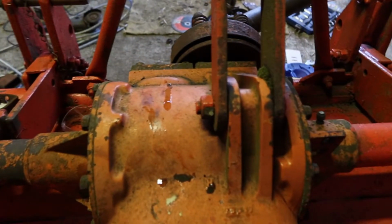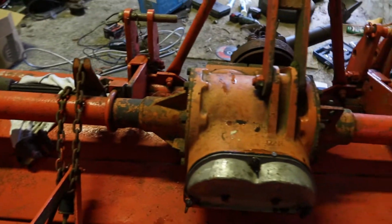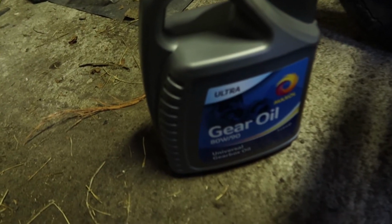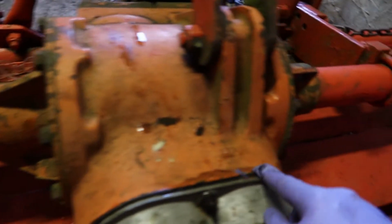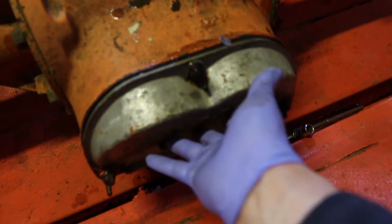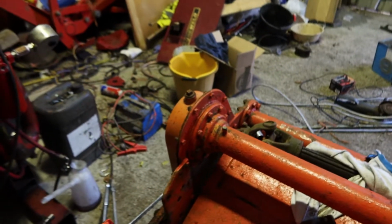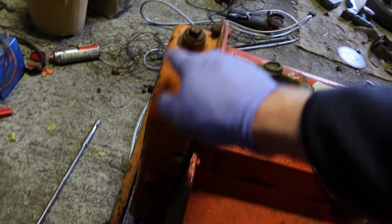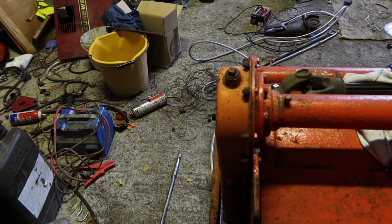Okay, that's the oil in there topped up with gear oil. So I think it's EP90 should go into that. Closest thing I could find in the suppliers was 80/90, so it's good enough. Just applied a little oil to that cork gasket before I refitted and tightened those bolts that I shouldn't have removed, so they hold the spare sets of gears. So I'm going to take out this plug now, and I'm going to take out the plug down here and basically fill the chain case up to this level with oil, and hope that it doesn't leak.